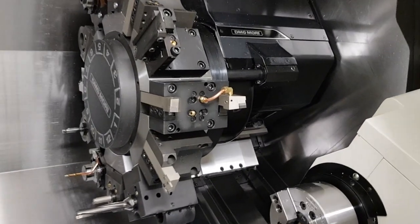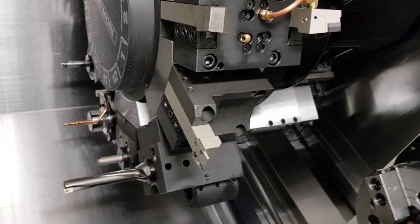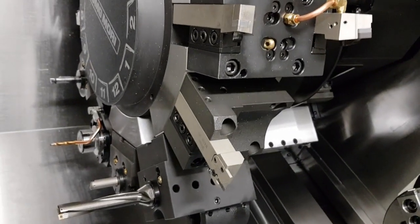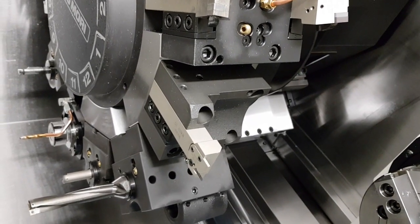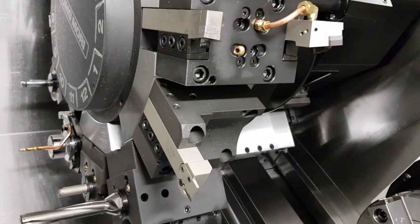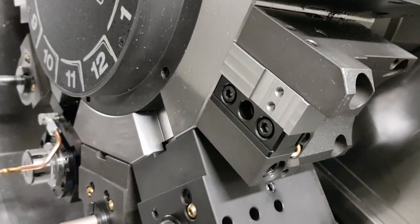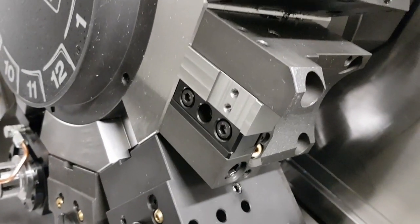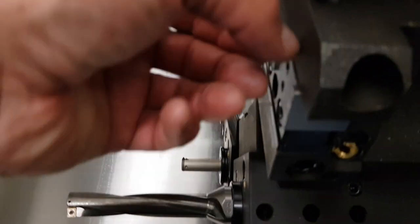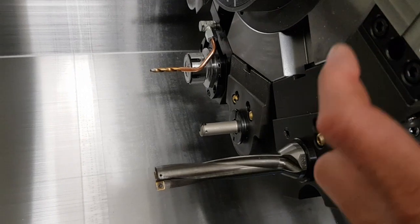So we're at the lathe. We need to test fit this thing — I guess we'll take out that grooving tool at position number one and see how it works. It's not the ideal position really, but I guess it's going to be that one. So there we have the first piece mounted. It's sticking out just a little bit, but this edge here has a slight clearance too, so when we tighten this it will tighten up against this and not this.